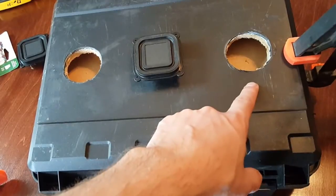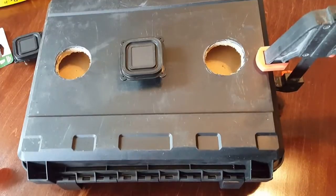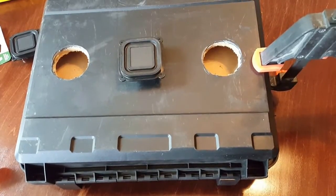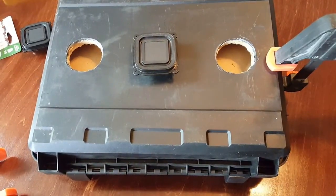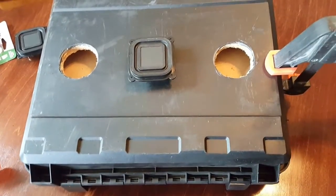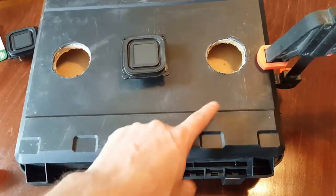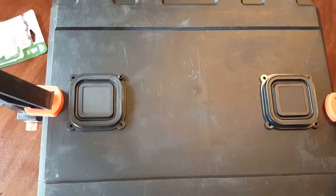The size of that box is the right internal volume for the sound we're trying to reproduce. The sound we're trying to reproduce is down to 200 Hz. I use a program called WinISD, which allows me to model the low-end frequency I can get with this. The best usable frequency I could find per size was about 0.007 cubic feet for these little speakers.